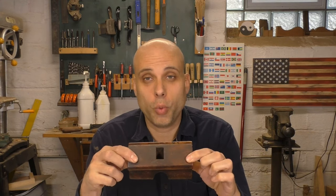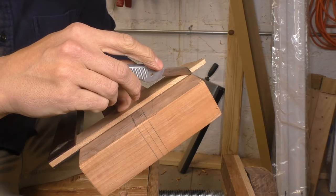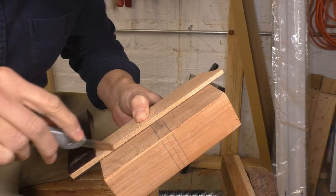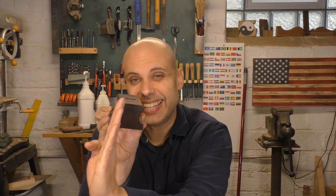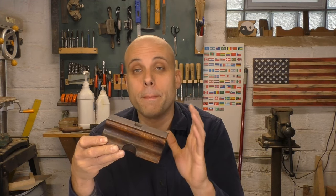If we were going to cut this mortise the traditional way, we would just grab a chisel and start chopping. If you are an advanced woodworker and feel comfortable doing that, go for it. But if you're more of a beginner, I've got a foolproof method. I'm going to take the front of my mortise, strike a knife line across it, and carry that line all the way around the stock using the angle at the front of my mortise to draw the lines down the sides. I'm basically taking the front half of the plane in line with my mortise, cutting it off, and taking it away — that's going to give me access to the inside of the mortise, making it really easy to cut and pare the bed until it's perfect, and then I'll just laminate the plane back together again.